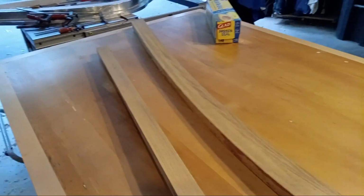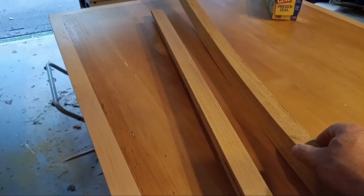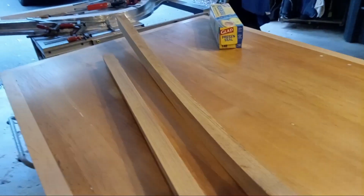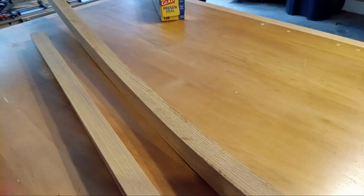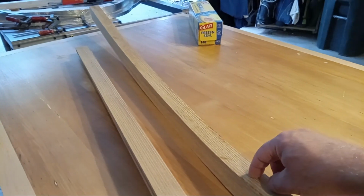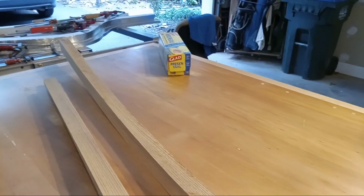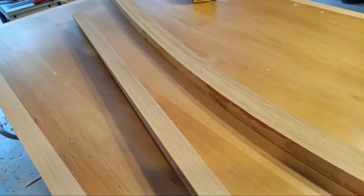And the thickness requirement for the top here is the width of the banding that I bought. I got some 1/8 inch thick silicon bronze band, a bar basically, and I'll just make U-shaped brackets out of it, and that's going to be what I screw into here, and then have a bolt, and then the vertical members supporting the structure. So that's what it is. So here I'm going to show my process for gluing these suckers together.